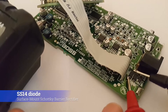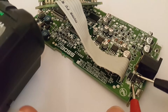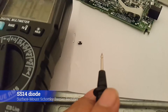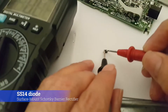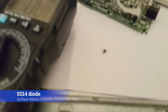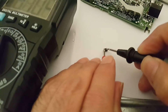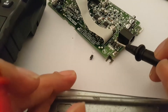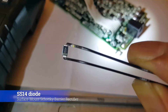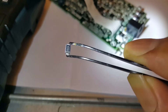This one is short, this one is not short. I'm going to try to replace it. Comparing with the new diode — this shows open line, and if you reverse the probe it reads 0.104, as expected. Please remember there is a line on one side of the diode — that is the cathode side, the negative side. Remember this line to place the component in the correct position.